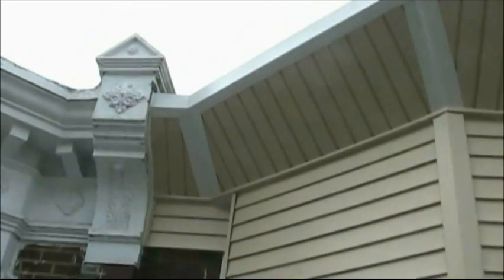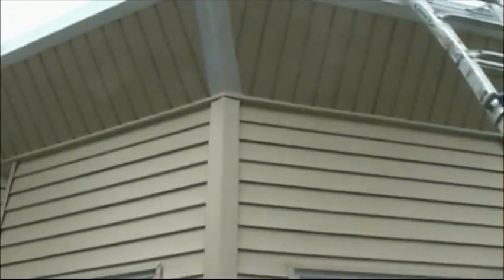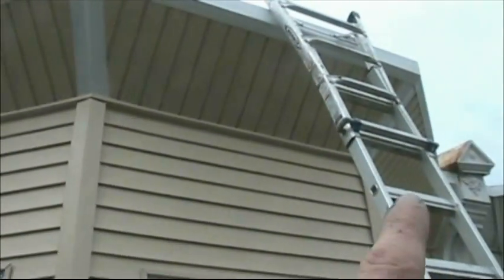Okay, back online. You can see all the capping and flashing is now placed on. You can see our J channels sit over the corner posts, so they're not open at the top. It's a common problem that gets ran into. Also under here, you can see everything's been closed off. Everything's been silicone and also mucked.